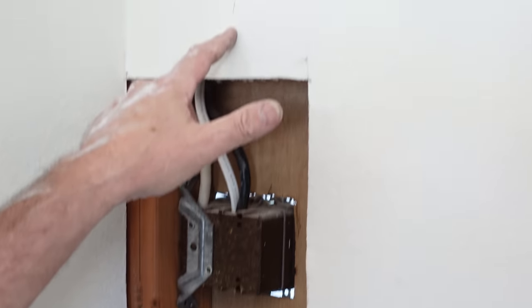The two safety issues: first, that plug over by the back door had reverse polarity — we fixed that. And then when the electricians were putting the plug on the cord here, we cut the cord because it was really long. We discovered that the installers never hooked up the ground to the plug — they just cut the green wire in this SO cord way back here. Why in the world did they not ground it? If we had a ground fault in this gate — like that ground fault on that refrigerator that gave me the worst shock of my life — some kid could come up and get seriously hurt. Now it's grounded and plugged into a ground fault. We are very safe.